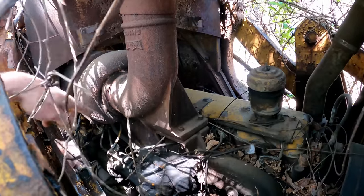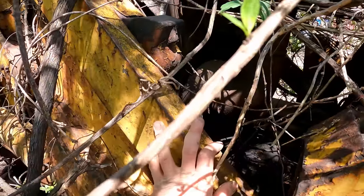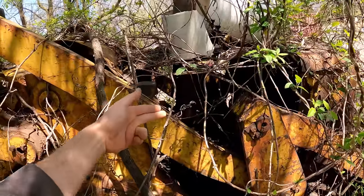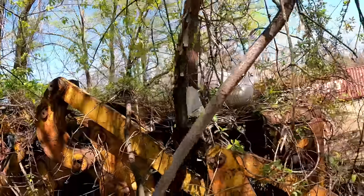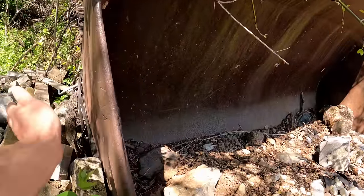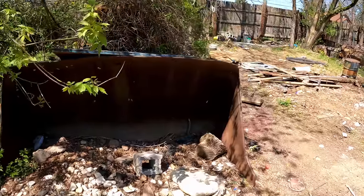Turbocharged. So that stack goes down, and then yeah, there's no drain or anything on it where the water would kind of drain out. When they have them set up like this, I always thought it'd be a great idea to have a T there that maybe just has a little weep hole, so in case the flapper is bad or there's no bucket on there, water doesn't go inside the turbo. And this is wrapping up the full 360 walk around. Let's clean some stuff off now and go from there.